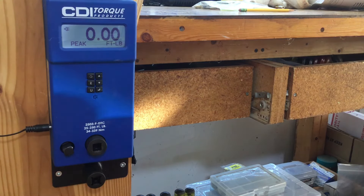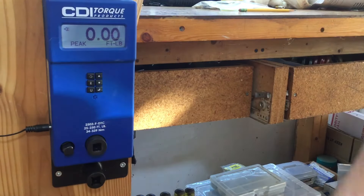I did four series of tests last week. At 100 foot-pounds it had a percentage difference of 3.87%; at 150 foot-pounds plus 5.16% difference; and at 50 foot-pounds plus 20.3%. That's way too much.